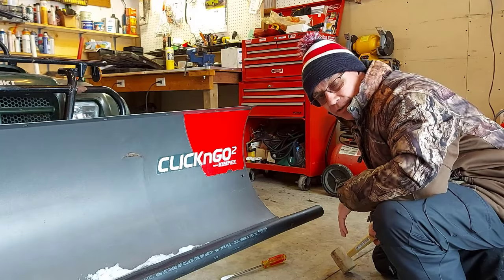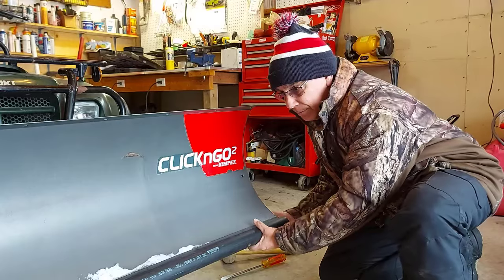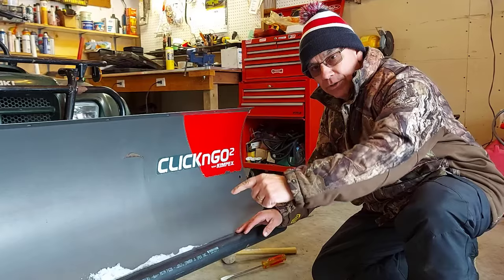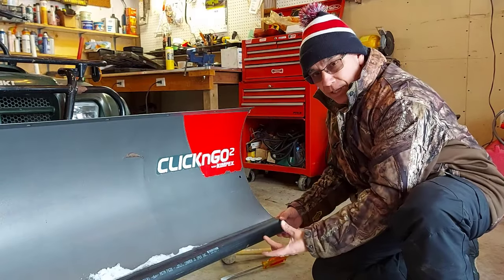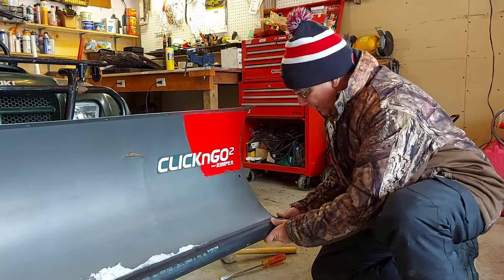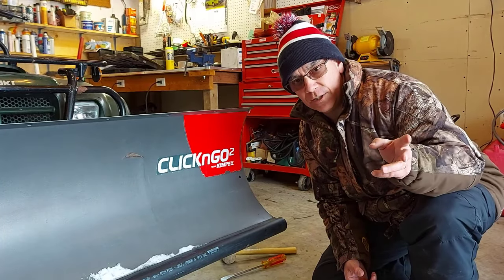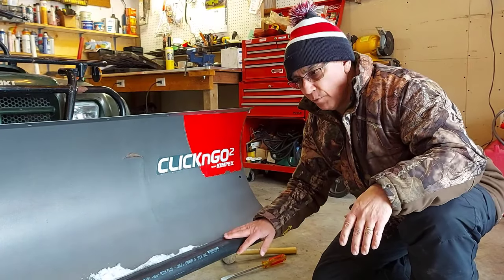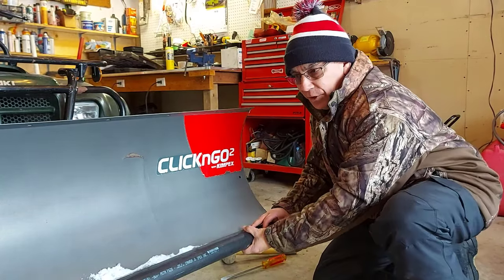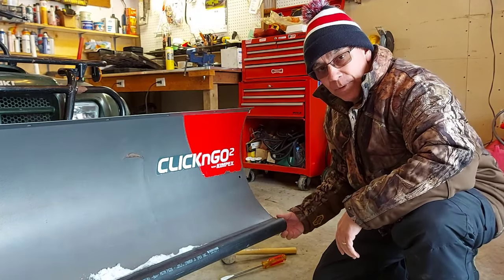If you like this idea and this video so far, give us a like. There we go — the ABS pipe is on the blade. The steel wear bar at the bottom of the blade is put on with bolts and nuts, and the two-inch ABS pipe fits right around those bolts and nuts. It works perfect and it'll hold it on. Why don't we give it a try? I have a hard crust on my gravel driveway so I won't be able to use it there, but maybe I can try it on the lawn. It's going to lift your blade up about an inch and that'll stop you from moving gravel.